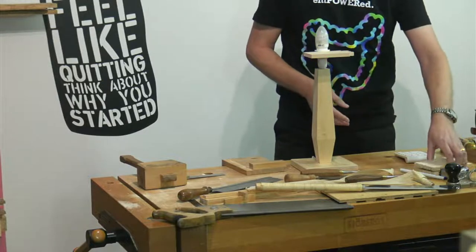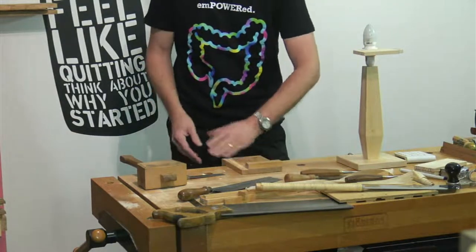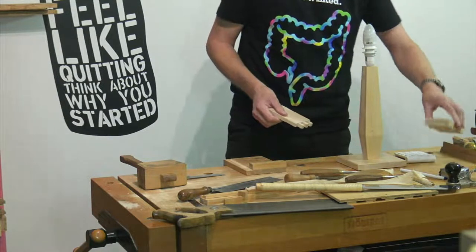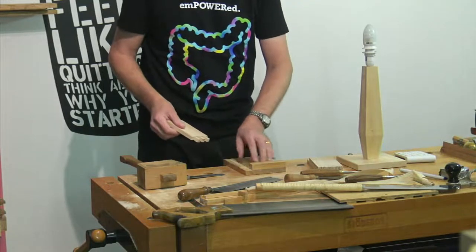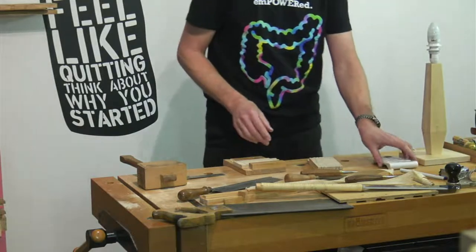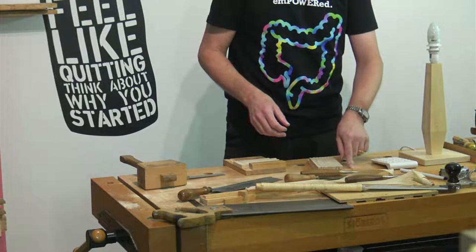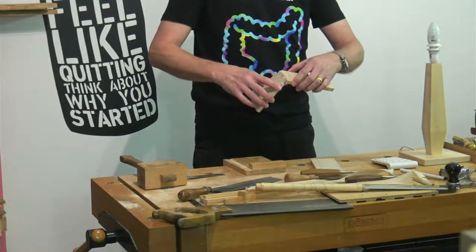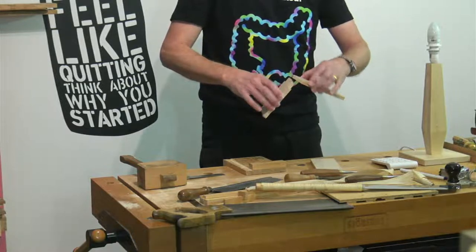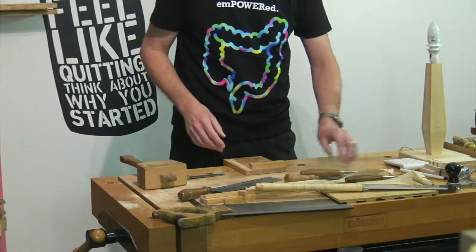I hope that explains it. It could have been really cool to use four thinner pieces with angled dovetails — if I'd known the angle that I wanted. But then you'd have two dovetails on the long grain, and it's never going to be flat, so there will always be some cross grain going on. Anyway, that's what those parts are going to be for, so I'll crack on and get those done before the next stream.